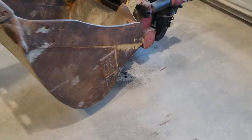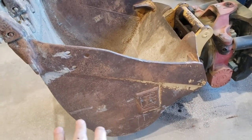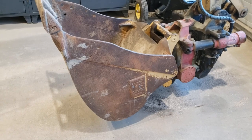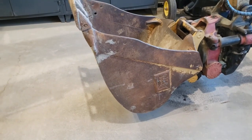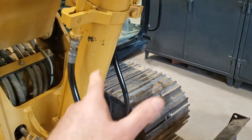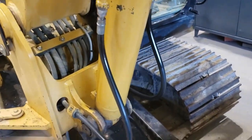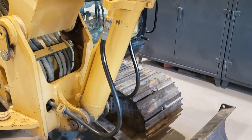We don't want to park it like that because the technician comes to work on it to change a hose — obviously we've got stored oil. If someone gets underneath this implement, changing a cutting edge or something, we never want to put any part of our body in a position where we're trusting trapped oil to hold an implement that could crush us. The more you learn about hydraulics, the less trusting you become of the systems trapping that oil — not least of which is the seals on a piston inside the cylinder — and you've got to understand what's happening in the hydraulic control valve to realize how unreliable that is when you're betting body parts on it.